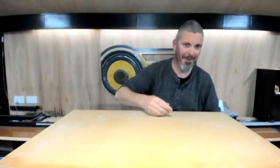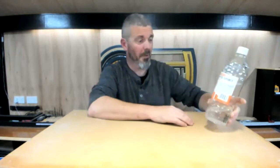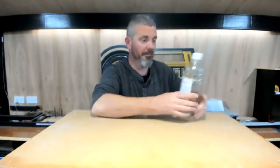Now, washing brushes and things like that is just one of those things you don't want to be doing, because you've been painting and you're probably a bit cranky from painting. White spirits cleans out your oil-based paint. It's just a thinner basically. So what that will do is wash it away. Do it in the sink. Be careful, don't be getting it on your hands, and certainly don't be getting it into your eyes. It's nasty enough stuff, but it's fine. It's no problem going down the sink. It's not ideal, but it's not the worst in the world. Don't use a lot of it either.